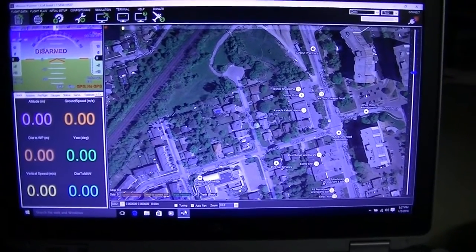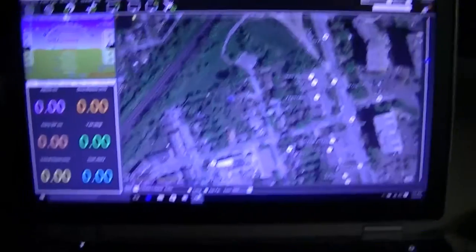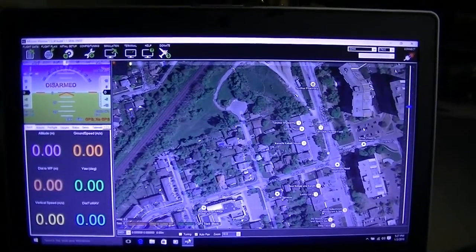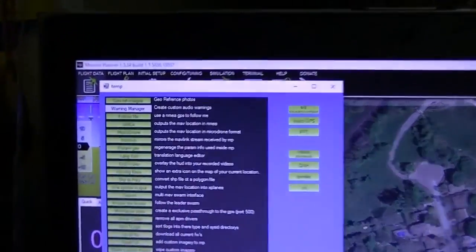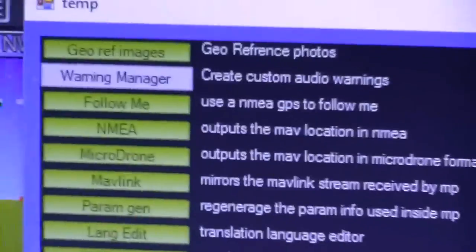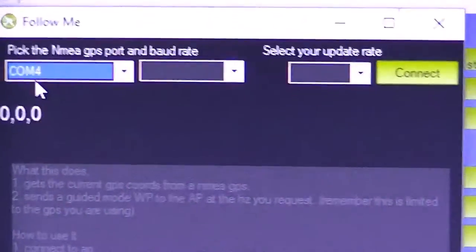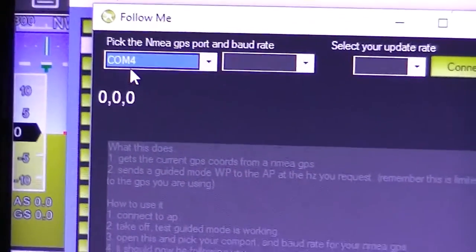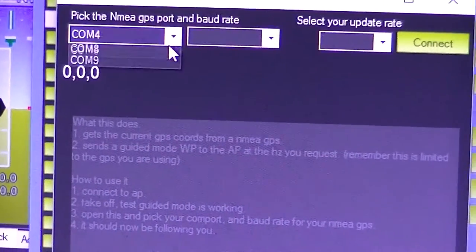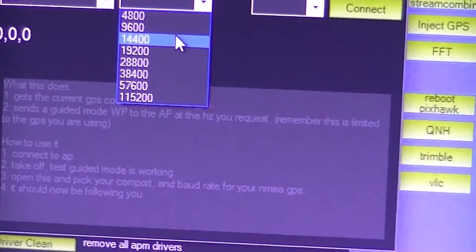Okay, once you have a known working GPS unit hooked up, you can go back into Mission Planner at this point, and the key is a magic key sequence, Control F in the flight data, which brings up a special window, and one of the options in there is Follow Me. So I'm going to go up to Follow Me, and this brings up a dialog box for your ground station GPS. And all you have to do there is choose your COM port, choose your baud rate, which we determined in PuTTY to be 9600 baud.